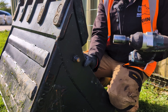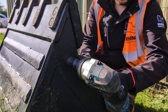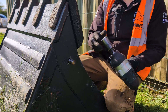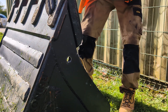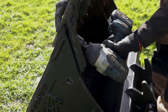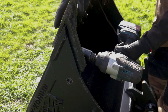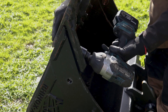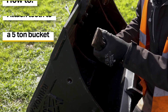To start off we're going to take out the side cutter bolt — all I need to do is put a socket on the nut and wind it off while holding pressure against the back of the bolt, then the bolt will slide out. Then onto the blade bolts, again applying pressure to the back of the bolt, then we can slide the two bolts out and remove the tooth.